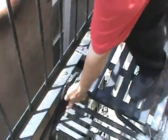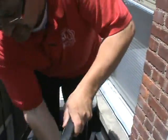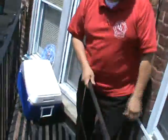Oh, clips right here. Again, just like the other one, rusted connections. Clips need to be rebolted. Banisters, they look in good condition. These are not major structure. This is minor structure that can stay the way it is. But the post is the major structure piece, so this needs to be reinforced.